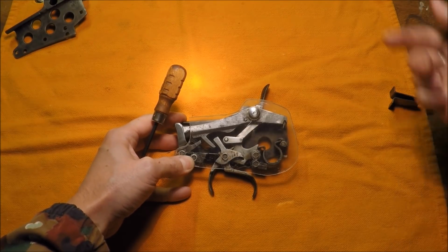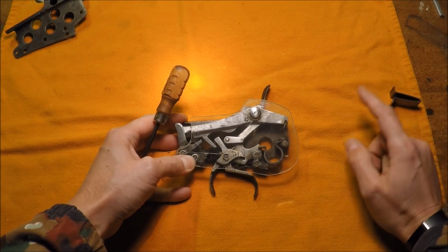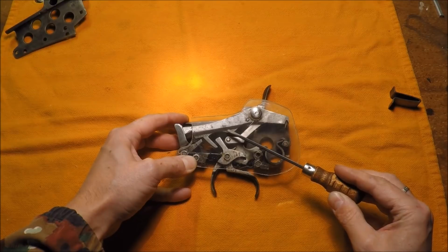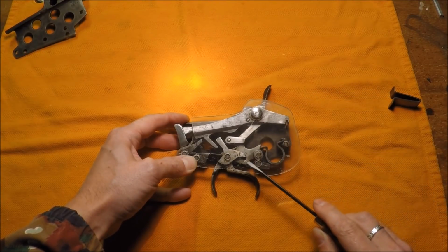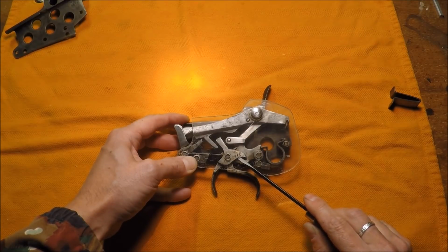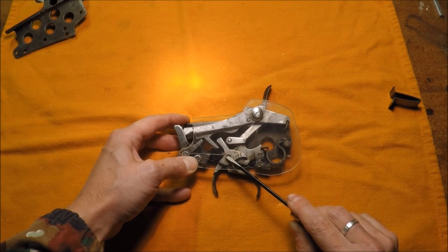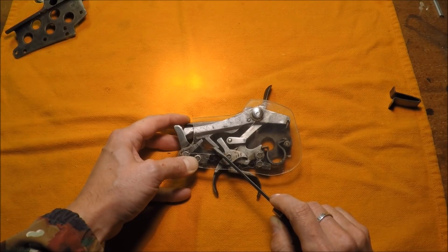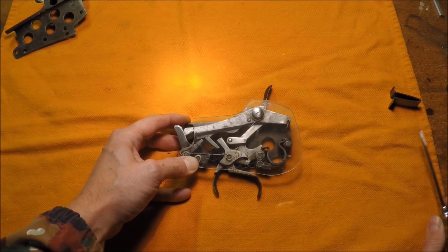The first thing that we'll do, load the cartridge, obviously, then thumb back the cocking piece. Now that's going to do a number of things which you have to watch. The roller is going to push on the camming surface that I pointed out earlier, which is going to tilt the block up. This stud here is going to push the hooked surface here up, causing the release trigger to pivot on this axis here, which is going to cause the locking lever to move down and underneath the strut, and the little ridge on the top makes sure it doesn't over travel. So let's just do that.